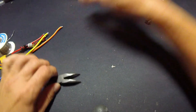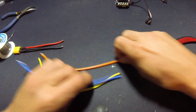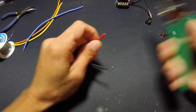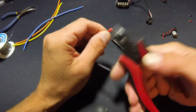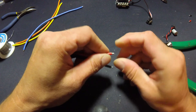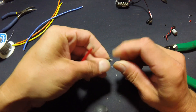All that work got the speed control just a little bit warm, so we're gonna let that cool down. While that's happening, let's go through how to prep some wires. The main thing you're going to be worried about is stripping and tinning your wires correctly. Use a proper pair of wire strippers — I see a lot of people just crimping in there with cutters or rolling with an exacto. What happens is you get a bunch of loose strands, you cut wires on the outside edge, and that leaves shorts as you solder everything into place.